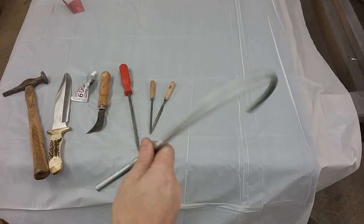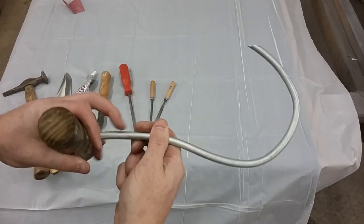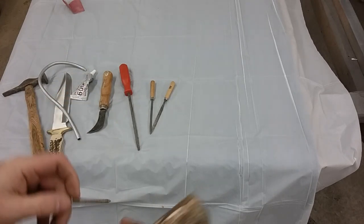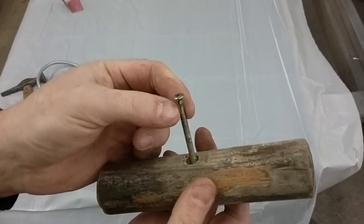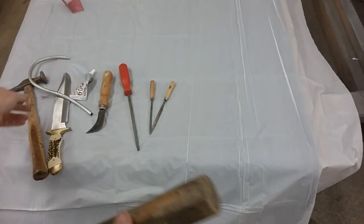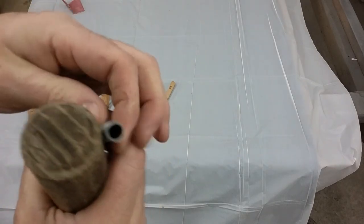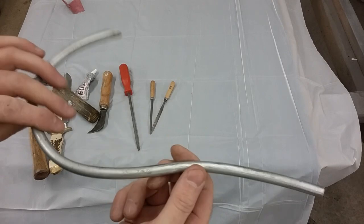I got my meat hook all cut. I'm pretty happy with it — I just bent it against the wall, cut the end down, sanded off the little burrs so I wouldn't stab myself. It fits in the handle pretty good. It's a nice beefy meat hook. So, how do you attach it? You could easily take a screw, run it in your pilot hole, cut the top of the screw off with a saw, then glue and slide your hook right down on top of it and call it done. But since I'm here at the shop, I think I'm going to go ahead and weld up my end. Although you could easily put a dowel in there and caulk it closed. I don't want any kid getting a hold of this on Halloween and putting somebody's eye out. I'm going to weld a little screw in the bottom so I can screw it into my handle — but I'm going to glue it as well.